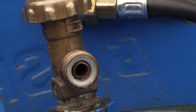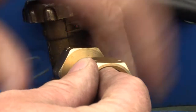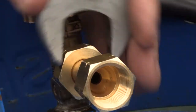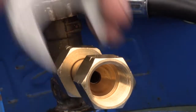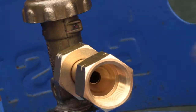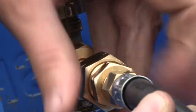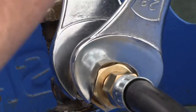Now we're going to connect the bottles. Always keep in mind that gas thread is left-hand thread. There are different connections on bottles. For all connections to gas bottles, we fitted a standard pole connection with safety valves inside. When you want to connect them to bottles with a shell connection, you need to put a reduction between them. Don't use Loctite or Teflon on it — just tie them up well.